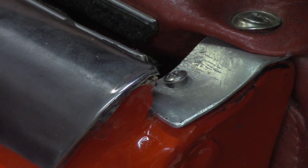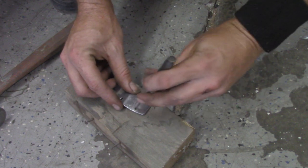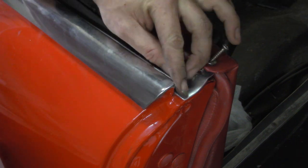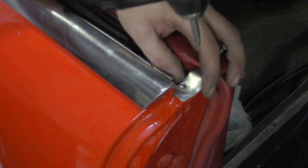I'll show you a little problem we ran into — the screw style we're using is not actually countersunk into the metal itself. So we're going to use the center punch. It has a bevel on it — a little bit primitive, don't need a fancy tool. Stick it into a block of wood, smack it down, and that will dimple that section out so we can countersink it. And it fits beautifully, just the way it should, as if it was stamped out.